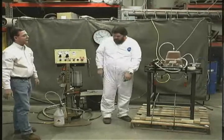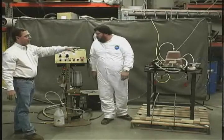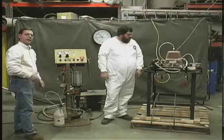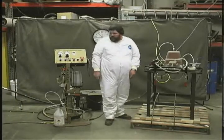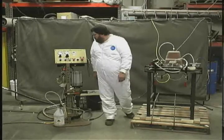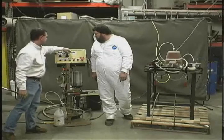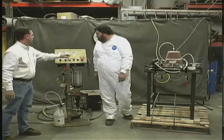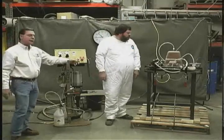That's a little bit on the fast side for this particular size part, but for the video we're doing it. We'd normally set this up in production so the part is injected at about 1.1 to 1.3 liters a minute. But we're expediting the fill a bit for this demonstration. In a moment you'll see the Aviator stop automatically at 12 counts — and there it was, about a minute to inject that part.